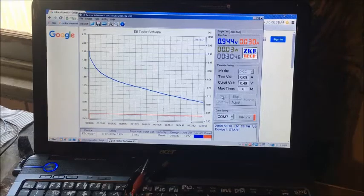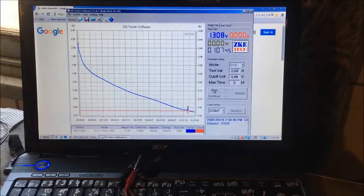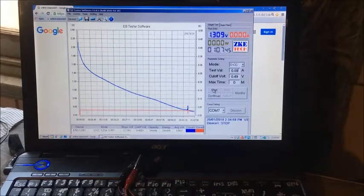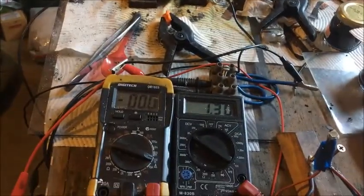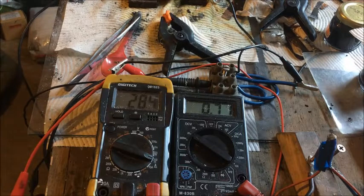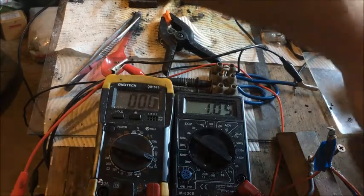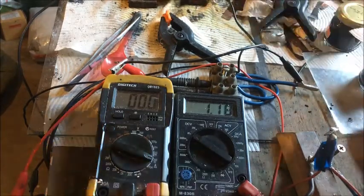Somewhat missed the end of it. It ran for one hour and did 33 milliwatt hours — that's still not too bad, considering when we put it together the short circuit was up near 90 milliamps, so we would have drained it the first run and this is probably averaging out. We'll do another half-hour charge, but first since we've got 1.3V — it matches there too, 1.3 — we'll run the motor for a second or two. Dropping rapidly. Yeah, good enough test.